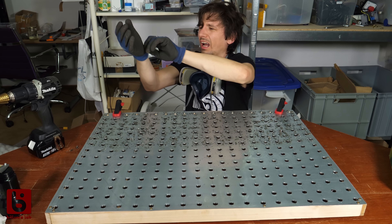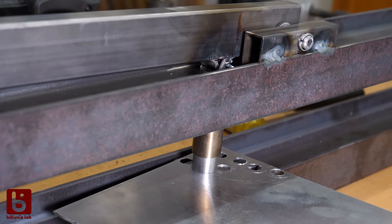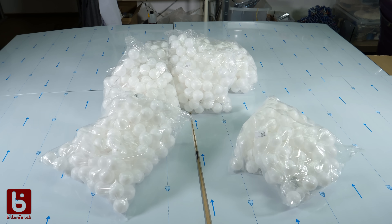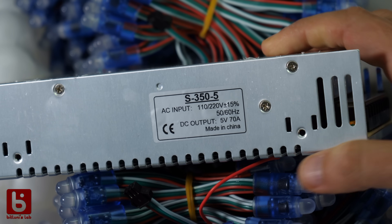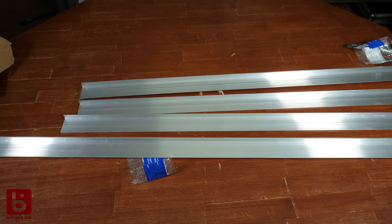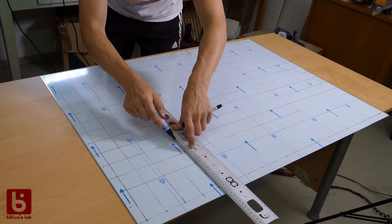Since the drilling of the steel plate was so painful, I built a hole punch in the last episode and decided to make the new one out of aluminium. To be transportable, it will be made out of four individual panels with a ton of ping pong balls and LEDs. To power this I got a 70 amp 5 volt power supply, which is really needed. The frames of the panels will be made from profiles of 15 by 50 millimeters, and the LEDs will be 5 centimeters apart this time.